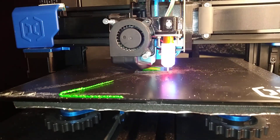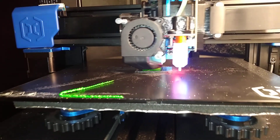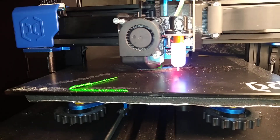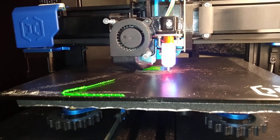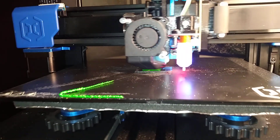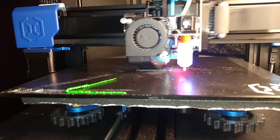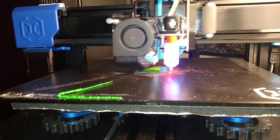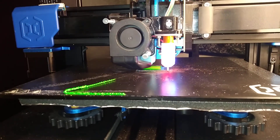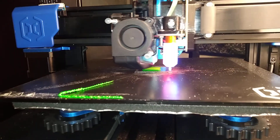I don't think it's a chemical bond — it's more that the paper is very porous so the nylon soaks into the fibers, but it holds quite well. I was surprised how much it improved my nylon printing. Nylon is very hard to print properly, especially the first layer, and it tends to warp. You should give it a try — just stick the paper down and print directly on it. Or if you have money to spare, you can always try printing on nanotape like I'm doing now.